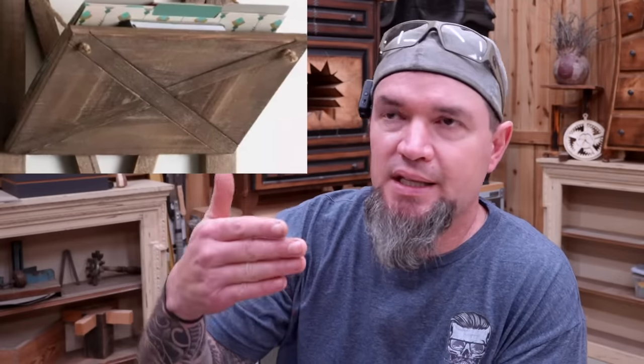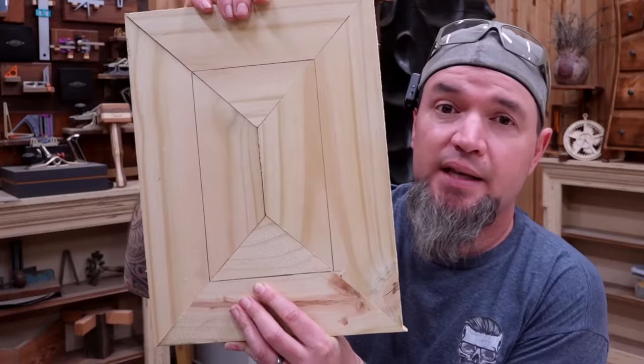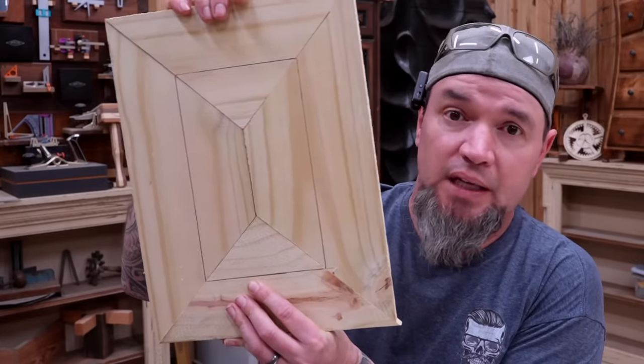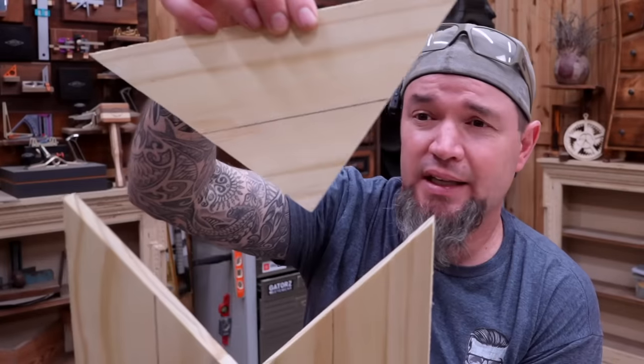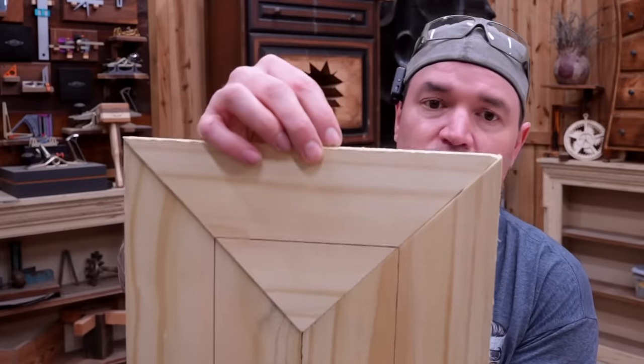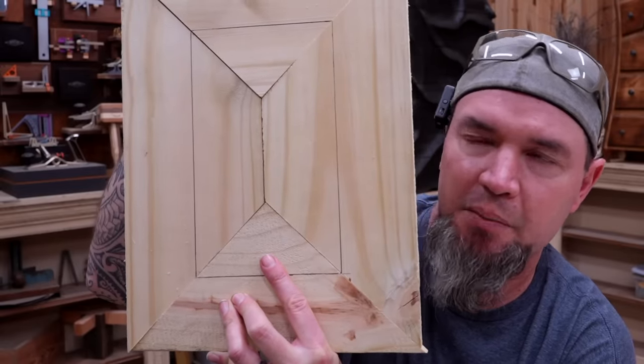So now you have the entire back done. Let's talk about the hanging folder shelves. I'm going to estimate that if this is 15 by 33, each one of these panels is probably about 10 by 15 inches wide. These panels are a lot easier to make up than they look. It looks like a cabinet front where you have your four outside pieces and then an inset board in the back — but that's not the case. If you look really closely, not counting the X design in the center, everything else is one panel. The only thing they've done is darkened the center to make it look like it's recessed. I just made this out of some scrap fence picket ends — it's a 15 by 33. The width is two fence pickets wide, and for the ends the 45s just meet in the center. You see this dark line going around? That's where I would darken the center to give it the illusion of depth, which is what they've done. I would attach all the parts using wood glue and brad nails.